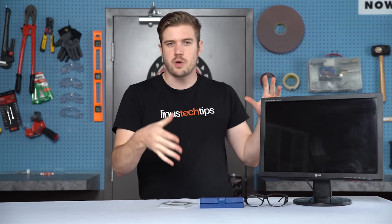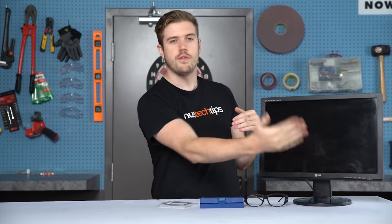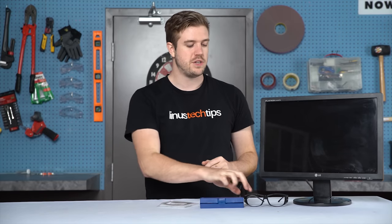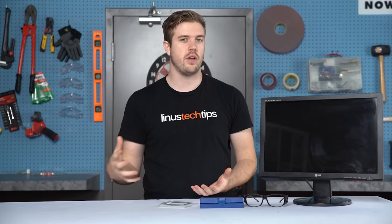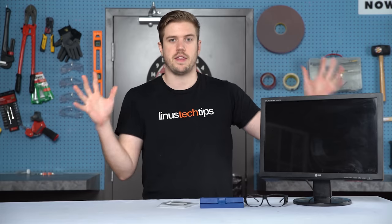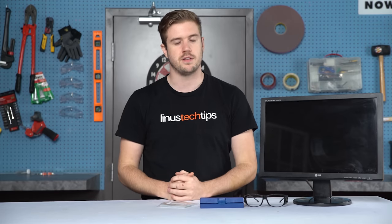There's a really cool trick effect you can do with an LCD or LED monitor where you remove the polarizing filter and then mount a polarizing filter into a pair of glasses — very easy to do with some 3D glasses. That results in a monitor that looks like it just emits white and nothing else, but if you're wearing the right glasses, you can actually see what's on screen. Let's check it out.